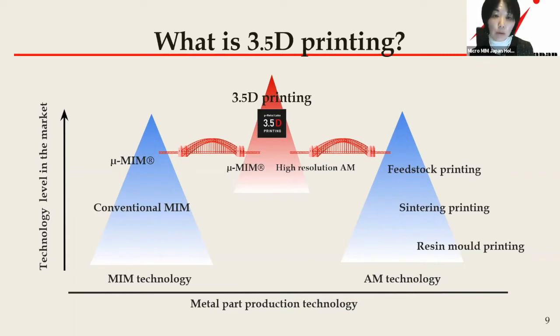Importantly, after this about 2-month startup period, you will enjoy high productivity with uniformly well-controlled quality components. In AM production, generally it takes 2 to 3 days or even less, depending on the availability, to gain the actual green body sample if there is a well-trained operator and a well-designed 3D CAD file that suits our technology. However, serial production, such as 10,000 pieces or 100,000 pieces or more per month, is not really feasible for this technology yet. Then it's better to use MIM.